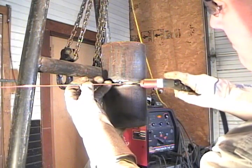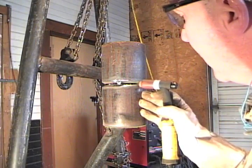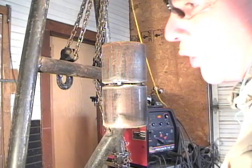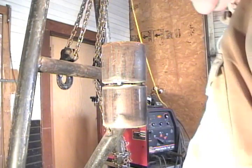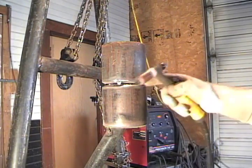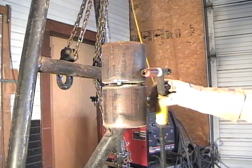So you'll just walk the cup, or if you want, you can position your fingers and come straight in and just go up and down with your rig that way. It's whatever you feel comfortable with, but I'd absolutely suggest learning to walk the cup. Some guys asked how to learn to walk the cup really well — the suggestion was to use a glass mayonnaise jar and walk the cup on that. I never did that; glass is a lot slicker than steel. I just did it in test booths, on the job — practice, practice, practice.